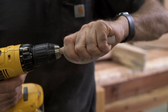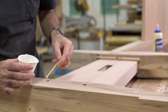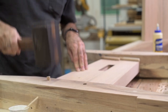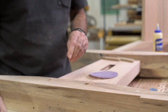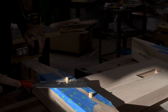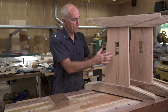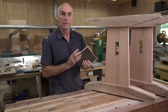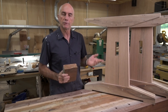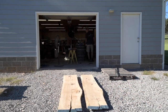I've put the dowels in the drill and I'm going to sand them a little bit. This morning I flush cut the dowels that were coming through and put a bit of tape on there just to protect the finish and put 220 on them. I was originally going to stain or paint these black but I did a little test piece — there's a black stain here and a very dark stain here and I didn't like either one. So I'm just going to go with it as is. It's time to move on to the top.